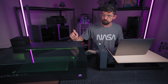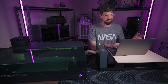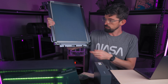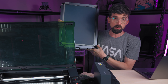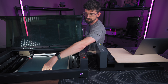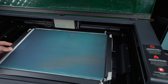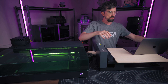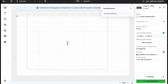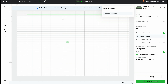Let's go through the full process. We've got the xTool S1 — specifically the 40-watt version — connected over Wi-Fi inside xTool Creative Space 2.0. I'm taking the screen out to show how it works. The notches on the screen go into the quick-release latches, and there's a bracket that screws into the S1 with pins that line up exactly with the screen so it always lands in the exact same position. We put the screen in upside down — screen surface closer to the laser head. In the software, we switch the mode to screen preparation, and you get a green crosshair showing the exact center of the screen and a green outline of the screen area.